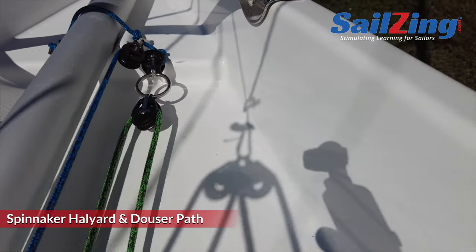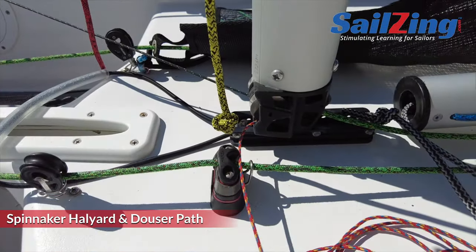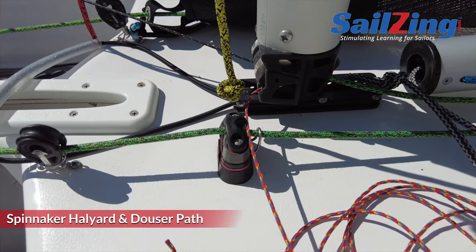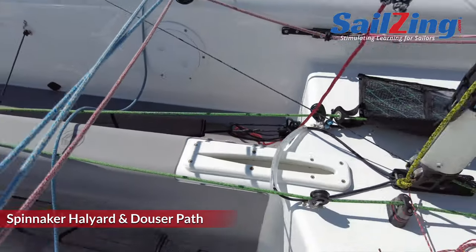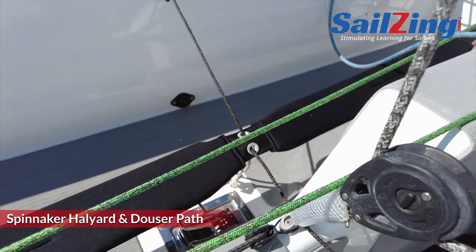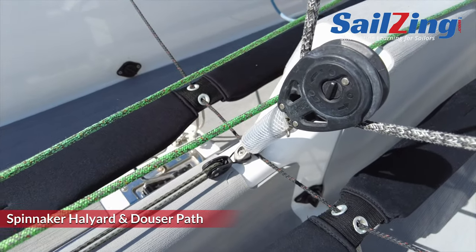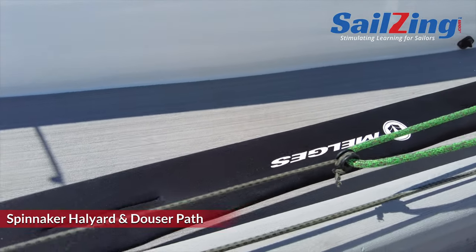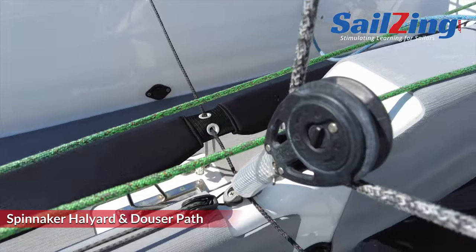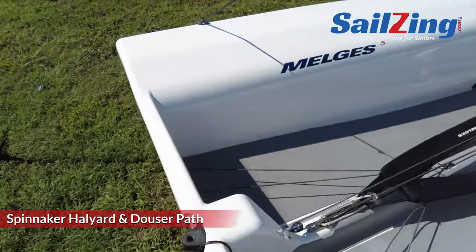So we're going to now follow that green line back to the stern, so you see it traces back along where it came out of the mast. It goes through this cleat, which is what cleats when you pull the spinnaker up. When you raise the spinnaker, you cleat it there. It comes back through a running block along the thwart, and then Eddie has recommended to run it on the port side of the mainsheet block, and then back to the eye, which is attached to a bungee that runs back to a block in the back, and that gives it the ability to have a lot of play. You see there's a lot of shock cord that plays into that, so it can travel quite a bit forward. Now we're going to walk around to the other side, to the port side of the boat.